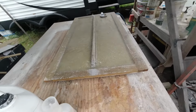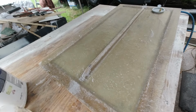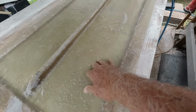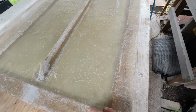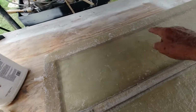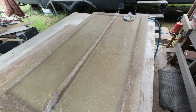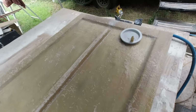So here's what we're working on. Okay, this is the lid to the engine. We've made some changes in the P35. The whole design of the engine access galley is all being done differently. So what we have is poplar, I believe, hardwood. And then we have birch plywood here. We made a frame all the way around. This piece here is a strong back, okay? That's to help, you know, I don't want any flex in this thing. People are going to be stepping on it, walking on it, and I want them to be able to step down on there with a sense of security.